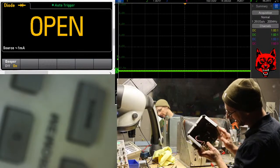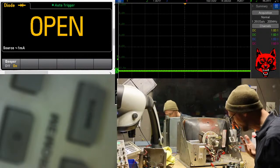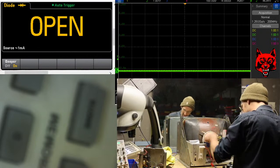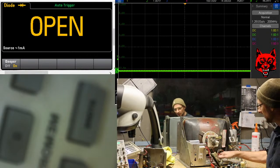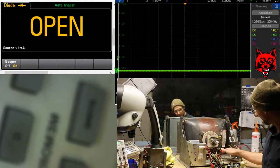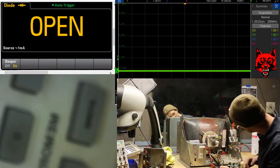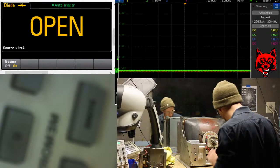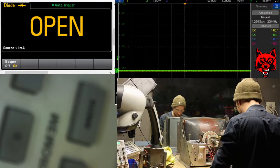I don't even know if this guy works. I'm just going to test the deflection out without any high voltage. He didn't send in a neck board either, so none of this has been tested. The only thing I looked at was the frame transistors, and they appear okay. There was some frayed wiring on a couple of them. There were opens on there, that's okay, but those should work for just the test here on the deflection. I want to make sure I nailed it.